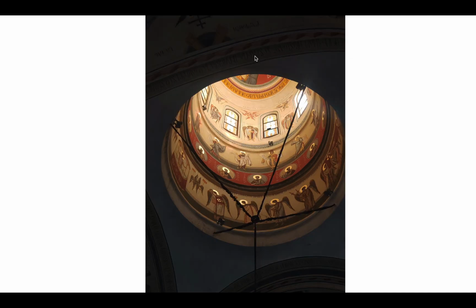On the next picture, you can see the focus only on the dome, having a height of almost 18 meters. I try to split it in half. So I use from the bottom of the dome 8 luminaires. You can see here two installed, another two here, and another two here, and the same setup. So I divide the height into 9 meters and 9 meters, and I use in total 16 luminaires.